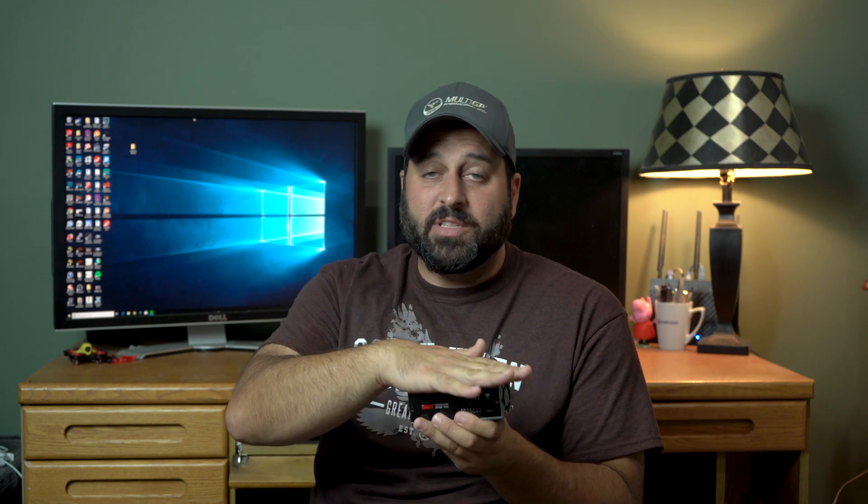For that reason, it can discharge at a much higher rate than your other standard chargers. There are more powerful dischargers on the market than this particular one, but you're not going to find one for $35 that works quite as well. There are also some really cool features you get with the ISDT-FD100. On the side there's a little jack — you can plug a cable in that lets you connect it to a computer to configure how the battery should be discharged, or you can plug it into one of the other ISDT chargers like the Q6. When you plug it into the Q6, you can go into the discharge settings on the Q6, set what you should discharge it to, and actually use this for the discharging.